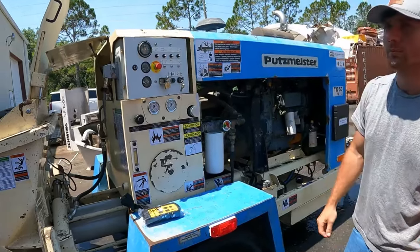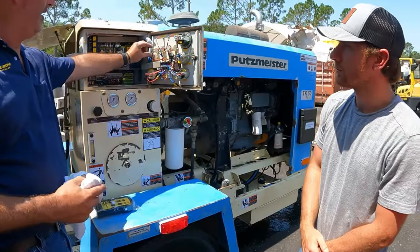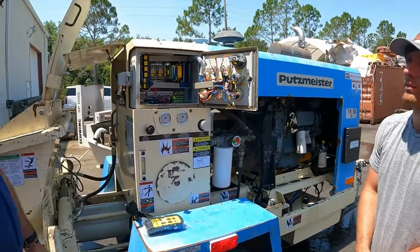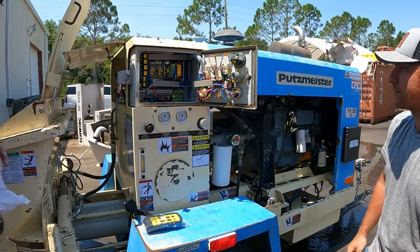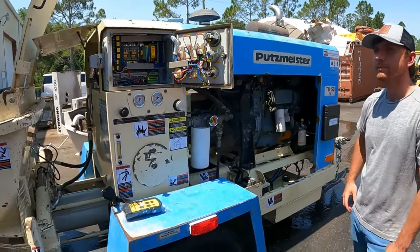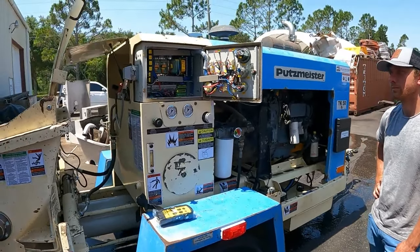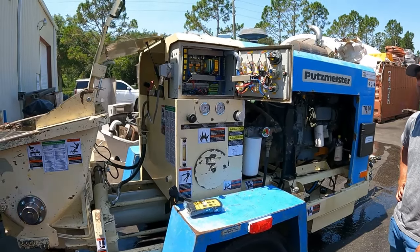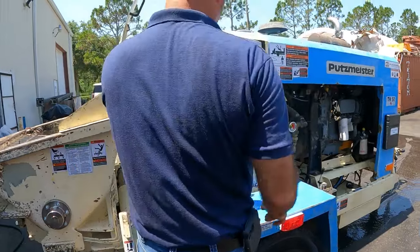A lot of owner operators usually wire them together. As you turn the key switch on, they'll put these two wires together and just screw them together. And when you turn the key switch on, it's always on. And that keeps you from forgetting. Because over the years, owners have figured out that they get a call, hey man, this thing keeps getting hot and hot and hot, and then pretty soon, in 2 or 3 years, the machine ain't worth a shit. They've been hot so many times, it fried all the cylinders out of it. So they wire them together.